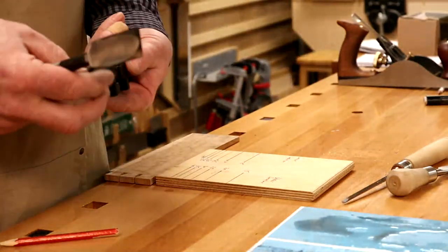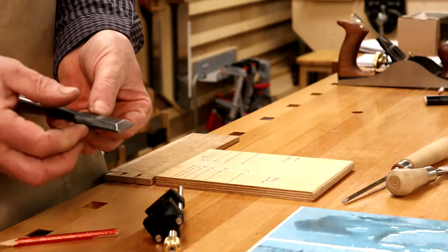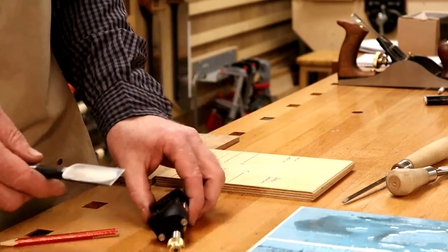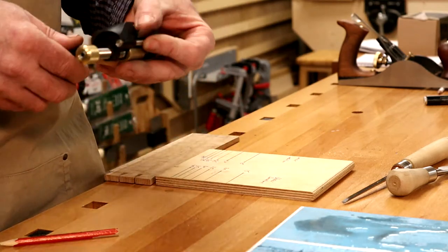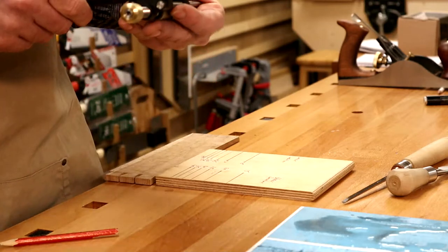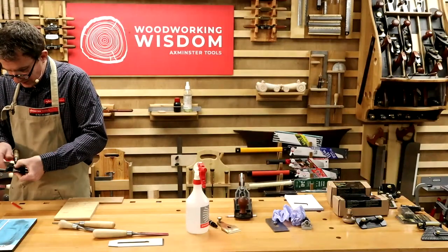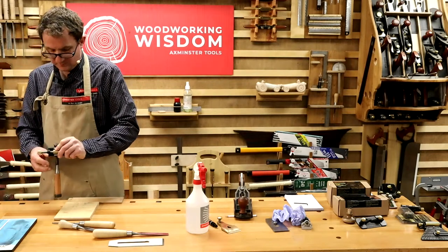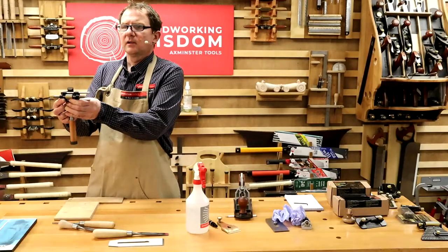Japanese chisel. Now, the Japanese chisel we looked at when we mentioned it the other week has a beveled edge side. They vary in thickness down here. They're a little bit handmade. They have a hollow back. Let's do the same thing. So to there, slide it in. I want to be at a lower setting. Now, I'm making this look fiddly because actually it is, to do what we're doing. Now, Ben, can you just go to there for me?